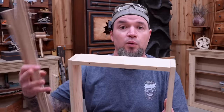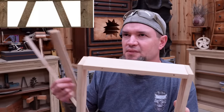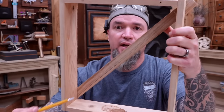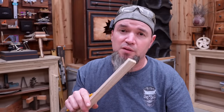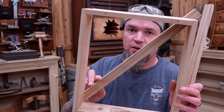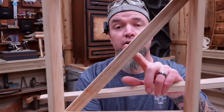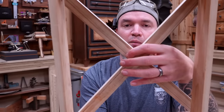Take two half-inch strips — theirs look about an inch and a half wide — cut those a little long. While the ends are square, lay your first one across from angle to angle, and from the inside make your mark on both sides. Now that you have your two ends marked, head over to the miter saw and make those cuts. If you've made this thing perfectly square, you can make those exact same cuts for your second board. Once you have your outside angles cut, you could either put a half lap on both pieces in the center, or install your first full-length piece, put your second one on top where it fits, draw a line on the top and bottom, make those two cuts, and everything would fit in flush — giving you that design.